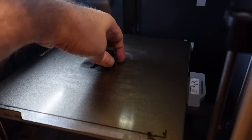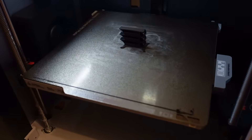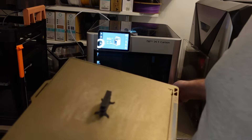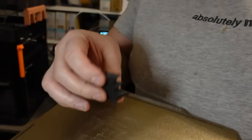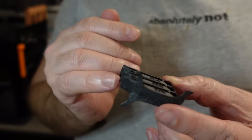Printing looks okay so far, there are some breaks because of minimal layer printing time. Printing finished a few seconds ago — bed adhesion check is great. We wait until it cools down. There is no smell like with the polycarbonate. Now let's remove the temperature tower — perfect. Again the quality is perfect on any temperature element: great overhang, great bridging, no stringing. I think I will print everything at 270 degrees Celsius.